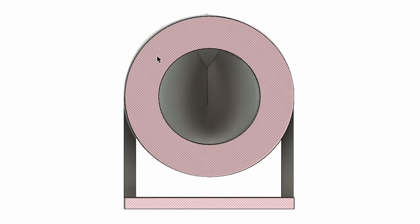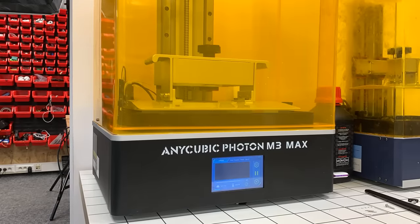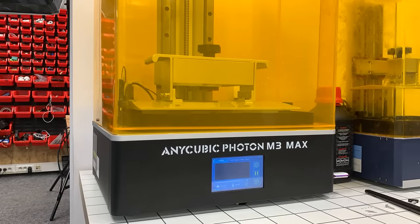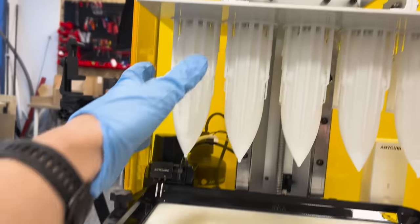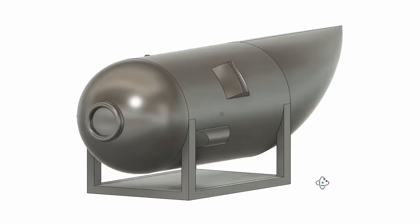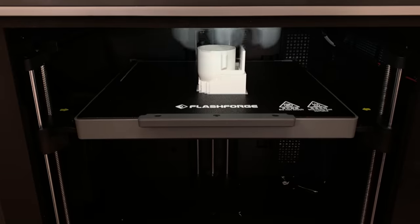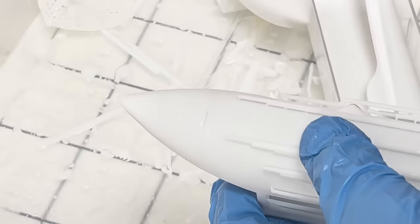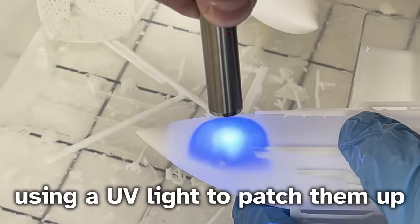It's time for some bigger tests — you might have seen one at the beginning of this video. I adjusted the printing settings so that the print goes above the resin level on each layer, which prevents suction. I wanted to test something with very thin walls, specifically 0.8 mm. An FDM printer doesn't even stutter, but here it has way too many holes and is generally very brittle even after curing. I had to swap the resin to a blue one, which looks really cool in UV light — now it at least doesn't have holes in it.